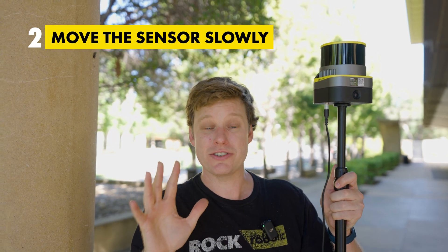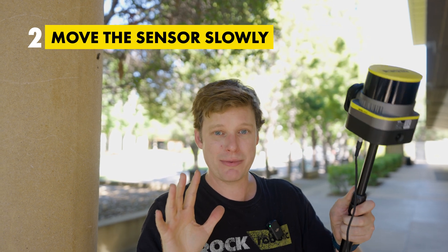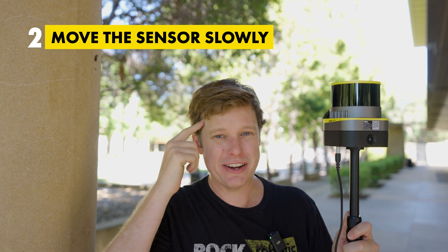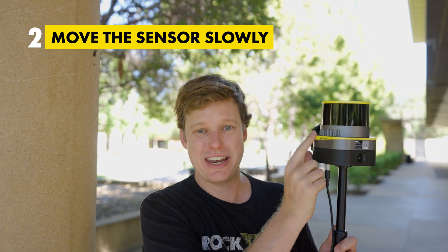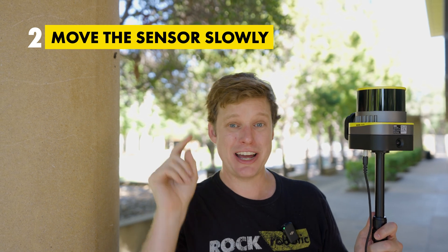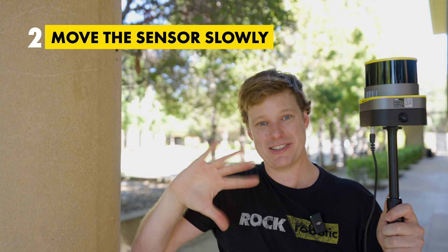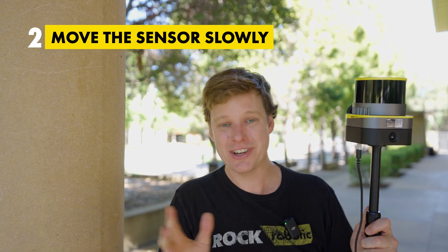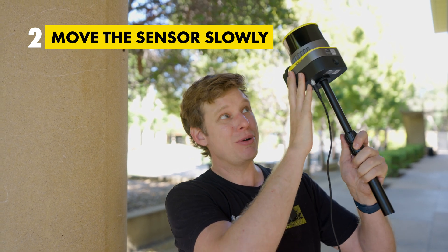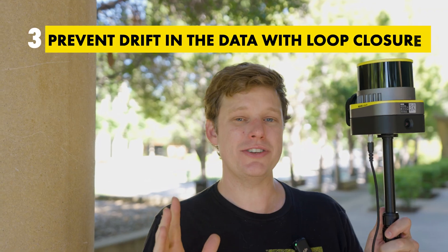The other thing I want you to do is move it slowly — you can actually paint with it a little bit. The laser is capturing data at about 10 hertz, 10 times per second. Think of it like a slow movie: you're watching this video at 24 frames per second, but this is at 10 hertz, so there's going to be a little motion blur. That's why we want to move it nice, slow, and steady so we can paint and get some good data sets.